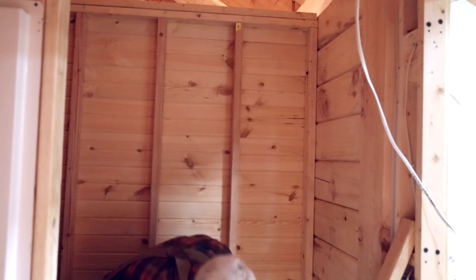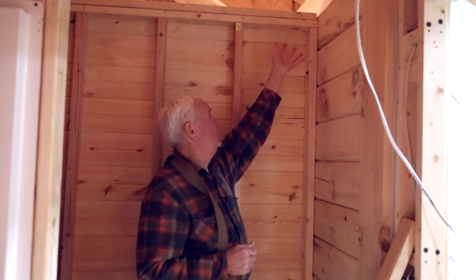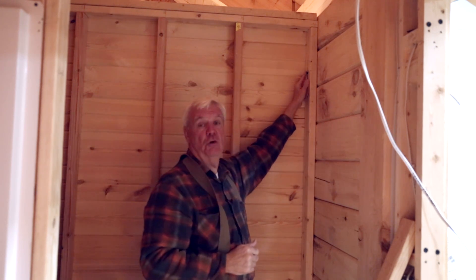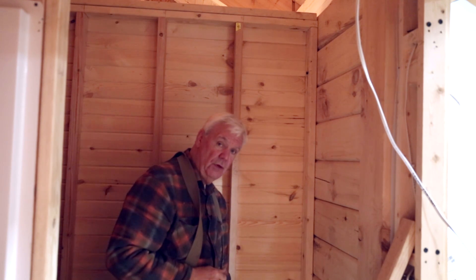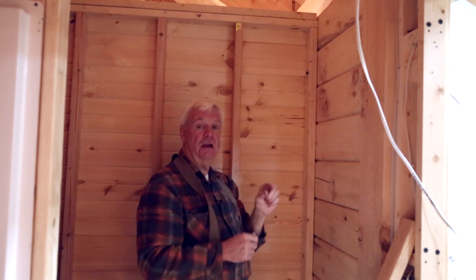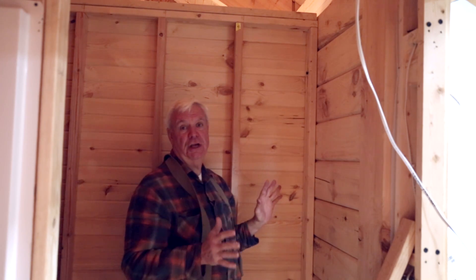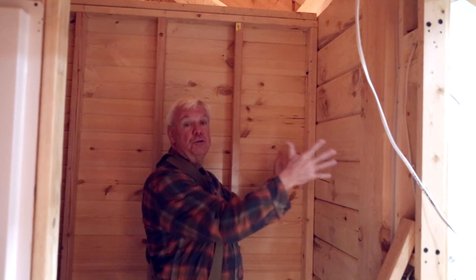The question is going to be: how is that wall fixed? Well, they're usually tied in with ceilings, and that's plenty of rigidity to keep the side-to-side or lateral movement out of it. We'll only fasten it once up on top. On the bottom, you can nail it into the bottom log because that's not going to move. But on the top, let that move — cut a saw slot in there, maybe three-sixteenths wide, something a little wider than a saw blade, then use a washer and a headlock screw, and you're all set for that wall that's going to intersect log walls between your verticals.